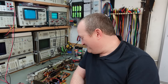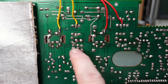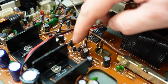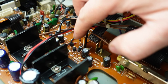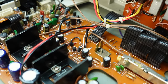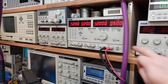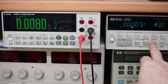The pads right here are a little bit knackered but they're a good connection — I've checked those. When we swapped the chip, the fault stayed in the location. So in the absence of better ideas, I'm going to try some of these transistors — for example, the mute function is done by transistor 106 and 206. I'll try removing that transistor on this channel. The current's dropped right down — 8 milliamps there, and 7 milliamps on the other. That's quite close.